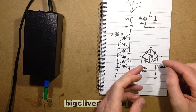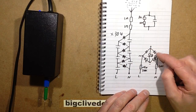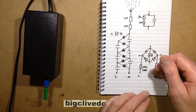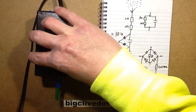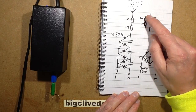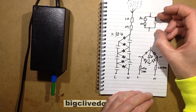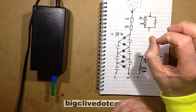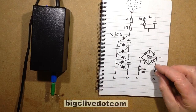And then I just tacked onto the existing neon's leads and used a bridge rectifier made from discrete diodes, basically a diode and an LED across it, so that no matter what the polarity, the current always goes through the LED. And the output, which isn't terribly visible because it is just a very dull neon, has that little capacitor and resistor and neon circuit, so that as the potential difference changes, as the ions emit out the end, the voltage across the capacitor increases until the neon strikes over and then it discharges the capacitor. So it just fires tiny little dots of light, just to give you an indication of how active the output is. It is a frivolous gimmick, it's not needed.